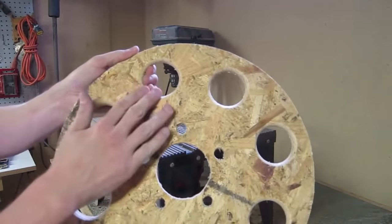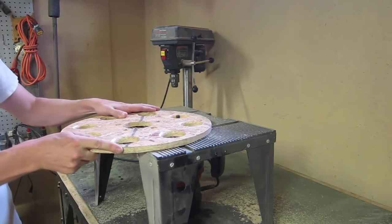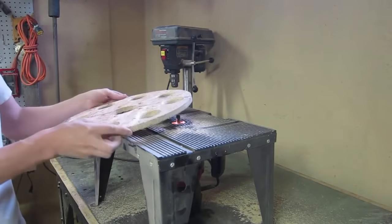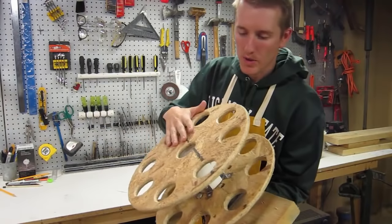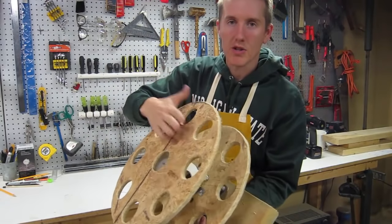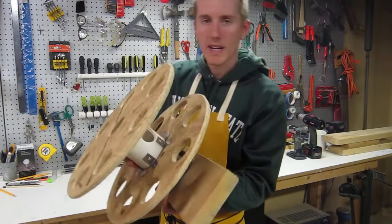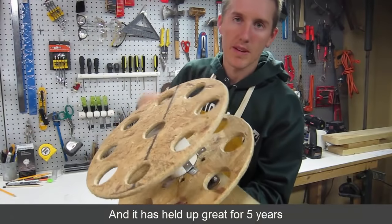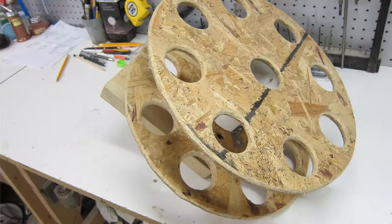Just to knock down some of these sharp edges, I'm using a roundover bit on the router. I had cut out the wheels before on the inner piece with the hole in the middle where the cord is going to feed through and out the front. But I wasn't sure how I was going to attach the wood wheels to the PVC center axle. I thought about it and came up with just making a whole bunch of small little right angles out of steel and then riveting them to the wood and to the PVC — this just seemed like the most stable, secure way.